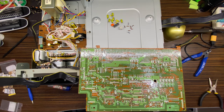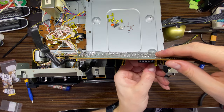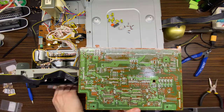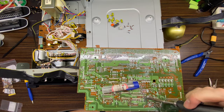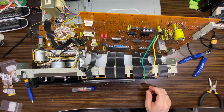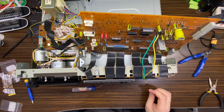Now for the quartz resonator, let's also use those leads. We will remove them after we finish the testing procedure. So let's solder them now. C519 and C520 are 1800 picofarads.